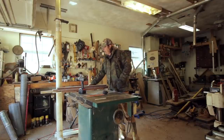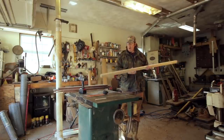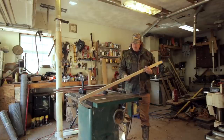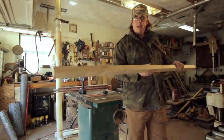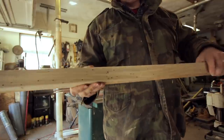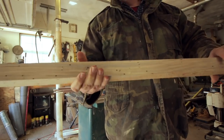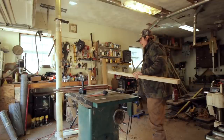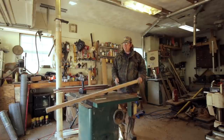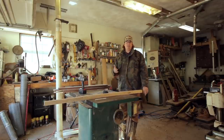For inside supports we've got to have something to attach everything to. Using what I have, I've got this piece of spalted wormy red maple. Spalted just means it's got some coloration in it from fungus — the log lay on the ground for a while before we milled it, and the worms got into it, which is what all those little dimple holes are. Some people love that when building furniture, some absolutely hate it. This piece happens to be exactly the dimension and length I want, so when I cut it into four pieces it'll give me what I need.